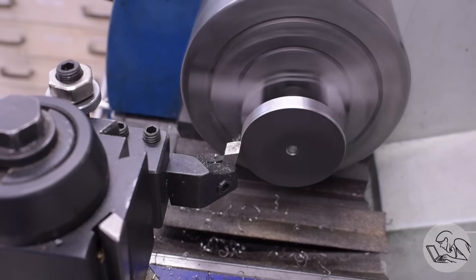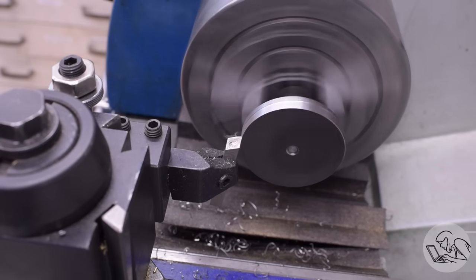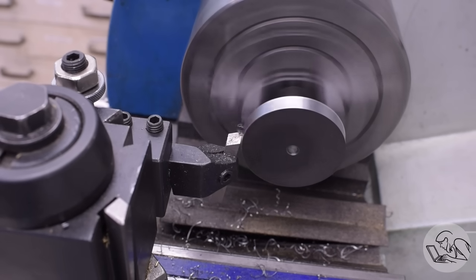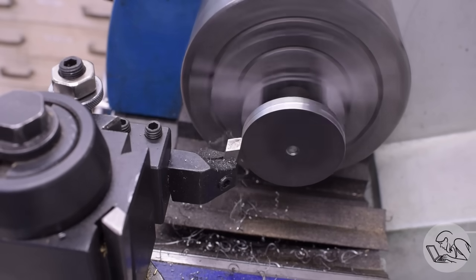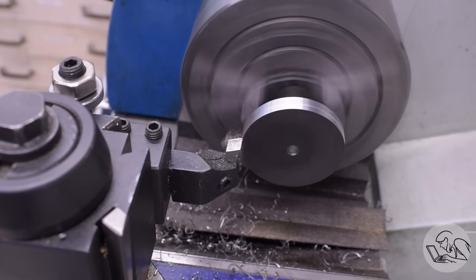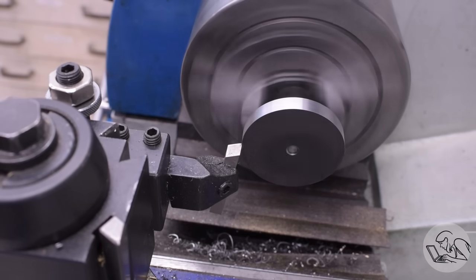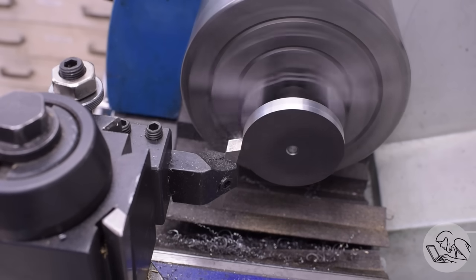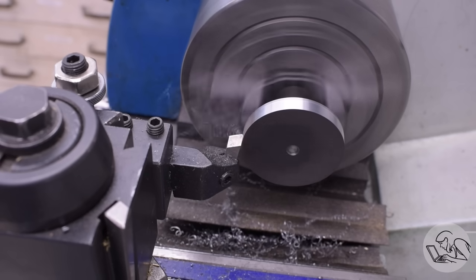One oddity here is that I have a lot of runout in the actual part before I start turning it. The mandrel is running perfectly true — I double-checked that. But for some reason this part is running out quite a bit, which suggests that my threaded hole is not very well centered. That may have been an error on my part — maybe I didn't do my center finding very accurately, or maybe the part just isn't very round. But what it boils down to is if I have enough extra material to turn down to a full cleanup cut, then we've reacquired concentricity. That's what lathes do — they acquire concentricity. I knew it was going to be close; we had about two millimeters to remove and the runout was just about two millimeters. I was a bit nervous, but we made it. Concentricity unlocked.